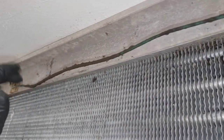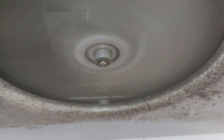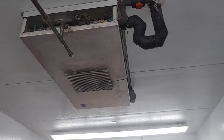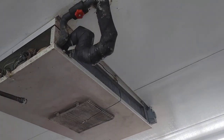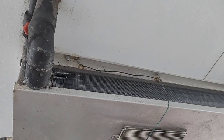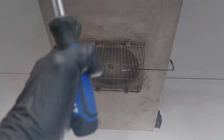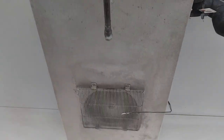Well, I can feel the air — it can breathe. And I can see daylight through there. You see that daylight right there? Never be fooled by these coils. If they look clean up there, that's because that's the outlet surface. These fans suck air up and out, so the dirty surfaces are on the inside behind the fans.